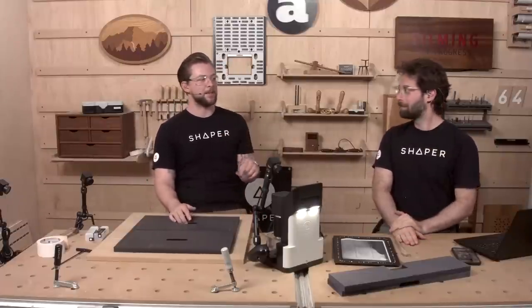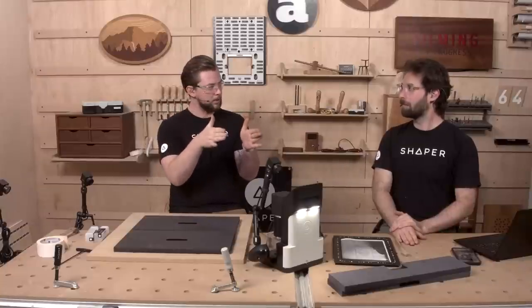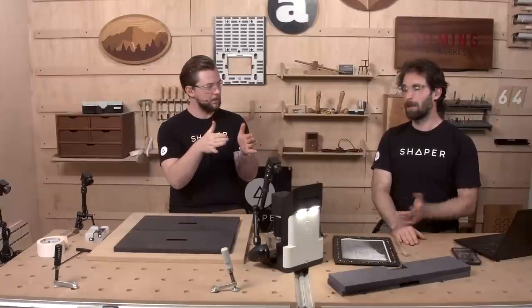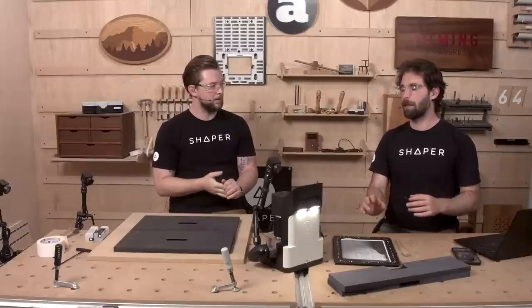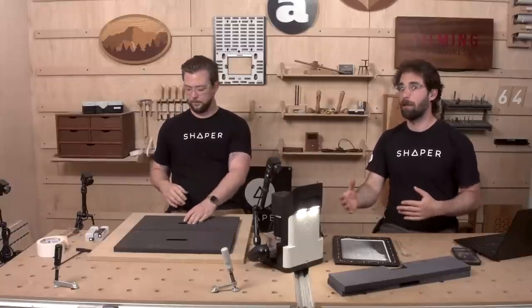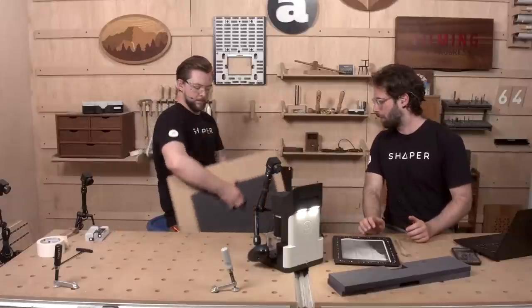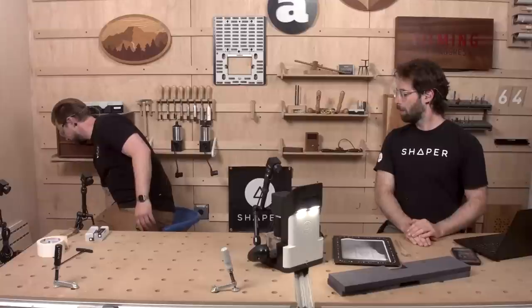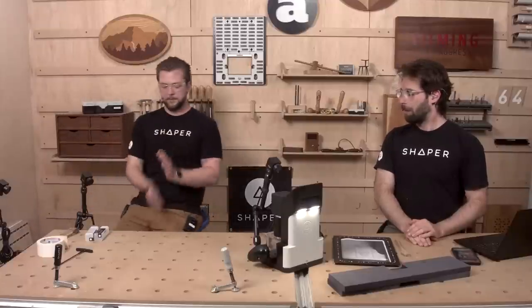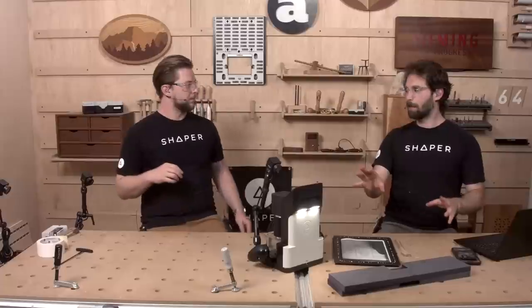When I did some testing earlier, I set my bit diameter to the smaller radius, which is about 12. So that 6 millimeter radius difference that I'm saying is actually a little bit extra, just in case. It's really closer to 5. But you always want to give yourself a little bit of breathing room. Okay, well, I think that's it for that one. We're going to come back to the coving bit after our kind of classic mid-show break.